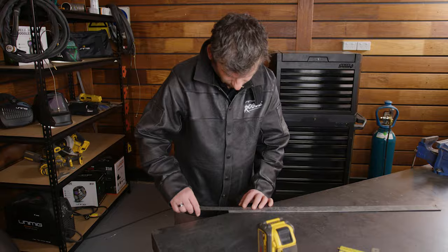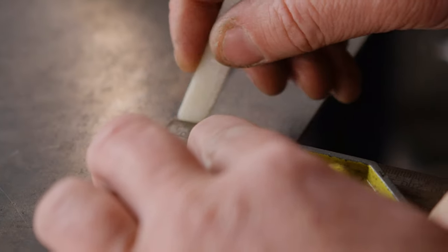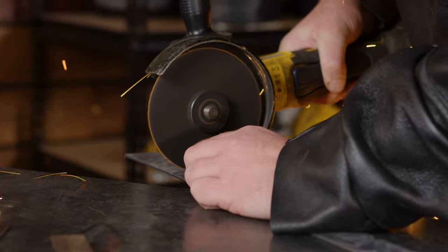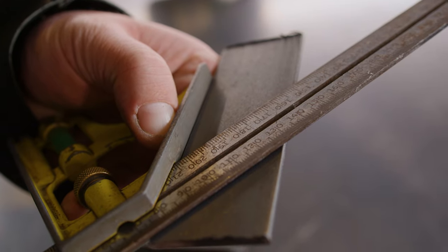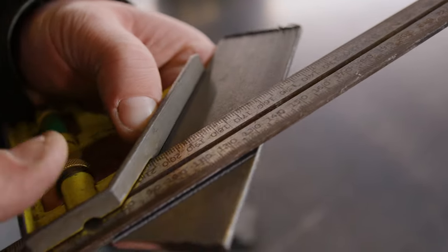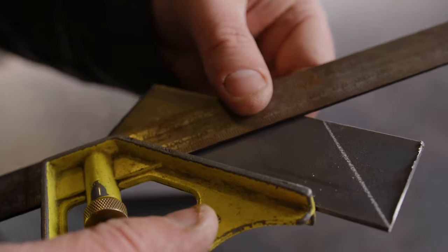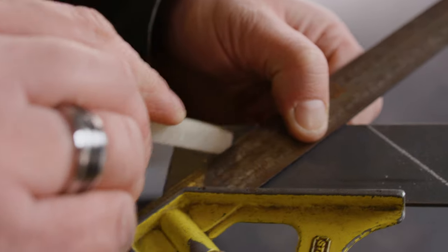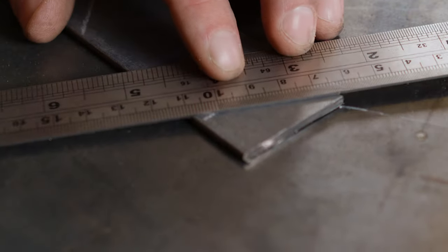First, measure out the flat bar. You need to measure 5 pieces at 120mm long. Now cut the pieces where you mark them. Now move on to measuring the cross angles. We will need to measure 8 45 degree angles. On the ends of two of your pieces, mark down 20mm and join the corner with that mark.